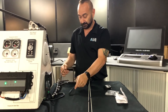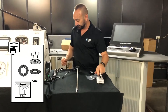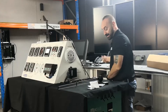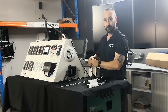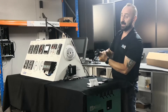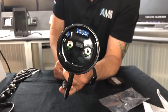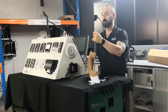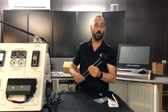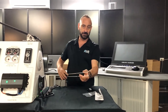Quite simple — you install it. It comes with the mounting kit so you can thread it straight in. For the N2K connection, quite simply into your backbone on your network. It will start flashing to show that it's on the network. Once it starts getting liquid past this level, it will stop flashing and start outputting to your system. It works in a percentage: 0 to 100%, 100% full, 0% empty.